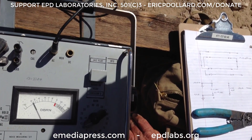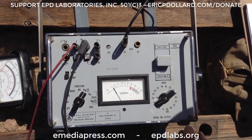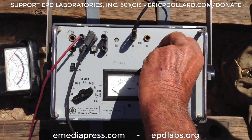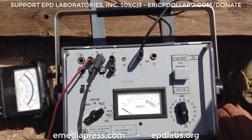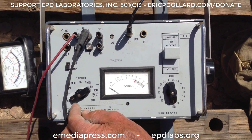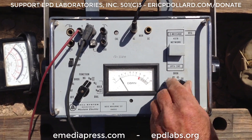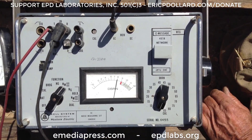With no termination, that should be about the same. Now there's a filter in this thing, being that it's designed to measure noise on a telephone circuit. So you take the low-pass filter out and put in what's called a C-message filter — that's the frequency response of the standard telephone handset, and that takes a lot of the deep hum out and leaves just the voice frequencies. So that allows us to turn the sensitivity up all the way.